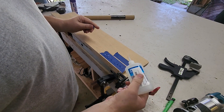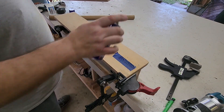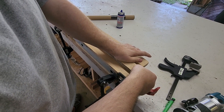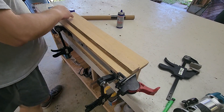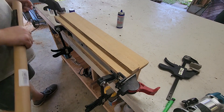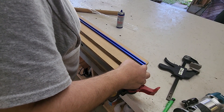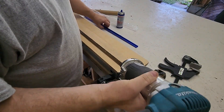Let's put a little CA glue on this side — this side gets the activator. Put a little pressure on there for about 5 seconds. Should be good. Looks like that's going to work fine. I'm going to go ahead and throw a clamp down on this end. This is the T-channel I'm going to want here — it's from Rockler. It's going to be a little bit short, but I've got some cut-offs I can fill that extra space with. The dimensions are 3/4-inch width, half-inch depth. I've already set up my trim router for those dimensions. Let me run this across and get that channel cut.